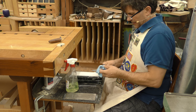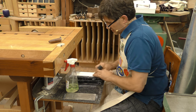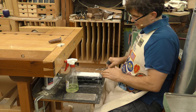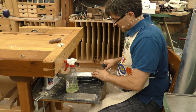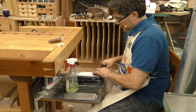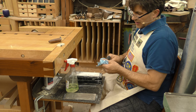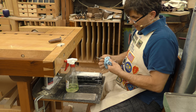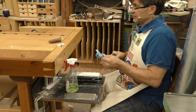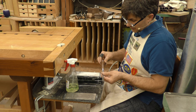Lubricate it. How much time will it take? Depending on the condition of your chisel and how wide it is — on a 3/8 inch chisel, I would expect to spend about 45 minutes start to finish. Once I'm done this, I never touch the back of that chisel again with anything but my final stone — in this case, a 16,000. That's the process for preparing the chisel. It's only a one-time procedure, so hopefully you'll never have to do it again, as long as you never touch the back with anything but that extremely fine stone.